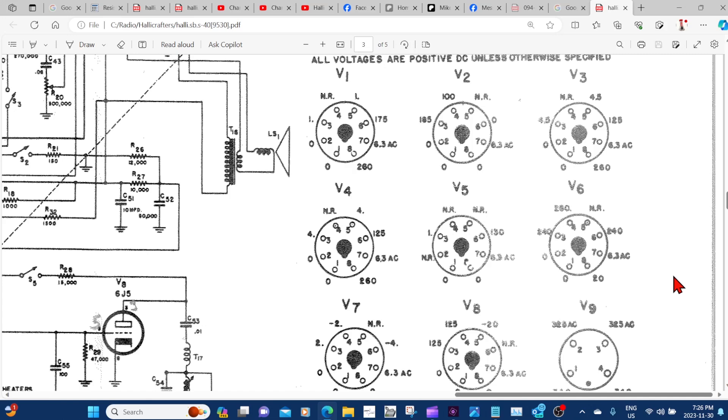Before we look at the schematic, let's talk about navigating under the chassis of a tube radio. Some subscribers say it looks like a big rat's nest in there. Try to look past that and look at the bottom of each tube. We're going to look at the bottom of the tube, where you'll see that each tube has a pin. These are octal tubes — find that pin and count off the numbers one, two, three, four in a clockwise fashion. This is how you navigate in an old tube radio.